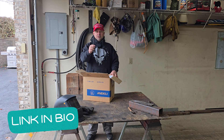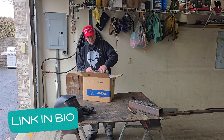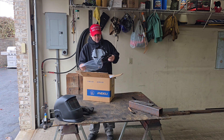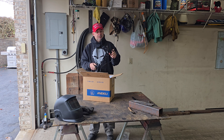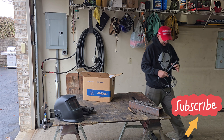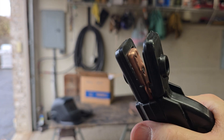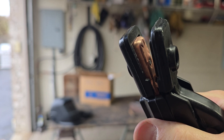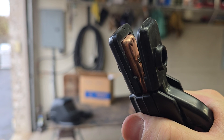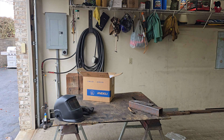They give you a basic inexpensive plastic firm bristle brush and an electrode clamp for stick welding - nice firm spring, pretty decent. Now here's a pet peeve of mine: the keyed pad. You can see the impressions for doing your 45 degree, straight, or 90 degree for your electrode. I prefer them to be deeper and more substantial so the electrode doesn't jump or move. They're there but very subdued in this case, similar to some others.